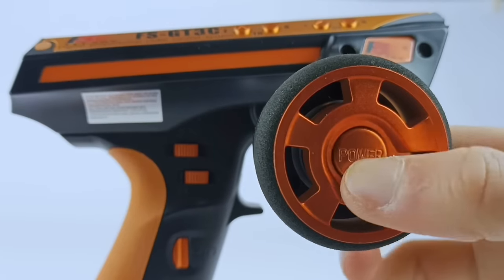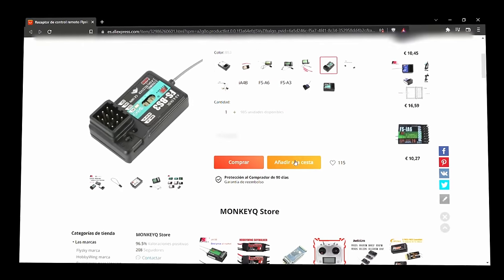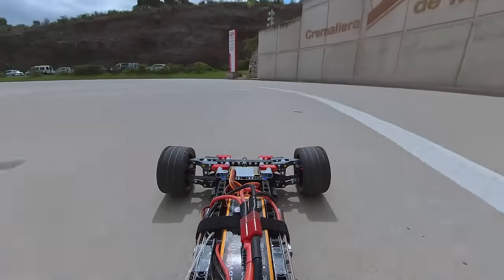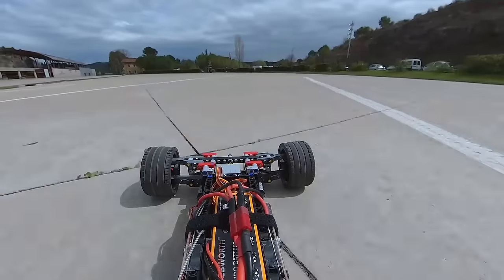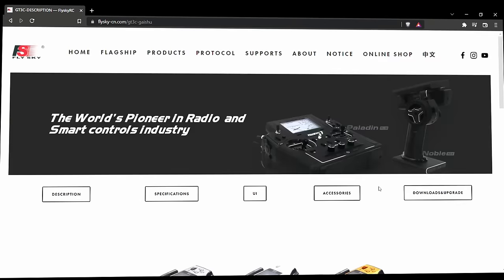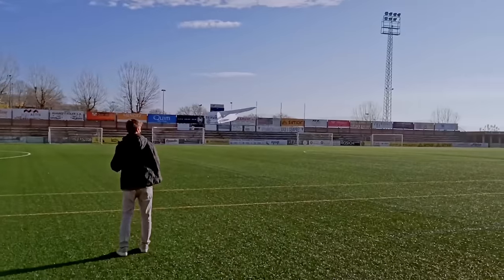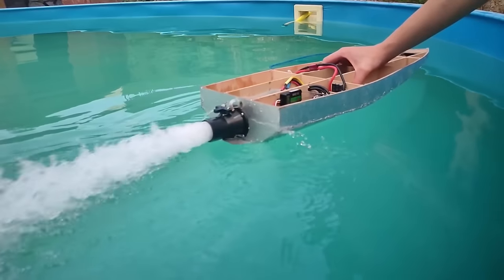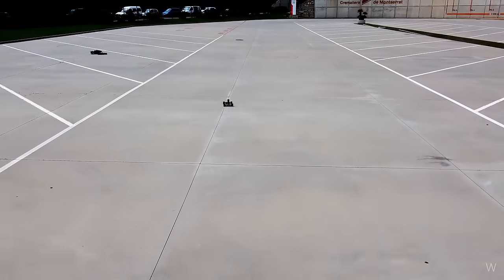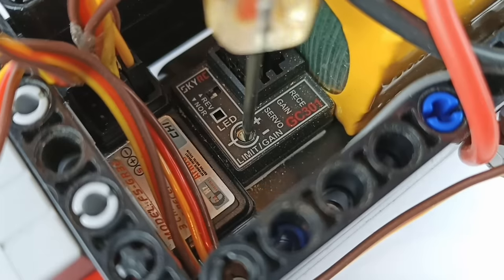It's a quite versatile design. Before receiving the two transmitters, I bought this other receiver also from Flysky, which has an integrated gyroscope sensor with active stabilization. This means it automatically centers the car to keep it in a straight trajectory. Unfortunately, even though both were from the same brand, the transmitter was quite old and was not compatible with this receiver. However, I already had a new Flysky transmitter for my other projects, which I could use to control the FS-BS4 receiver. I found out that this one didn't have the feature of adjusting the gyro, so the car wobbled uncontrollably. Finally, I ordered an external gyro on AliExpress which had physical adjustment features, and it ended up working very well.